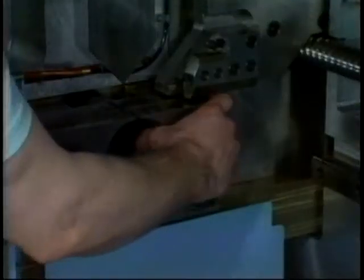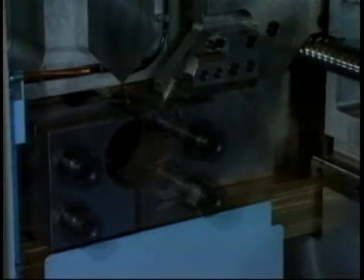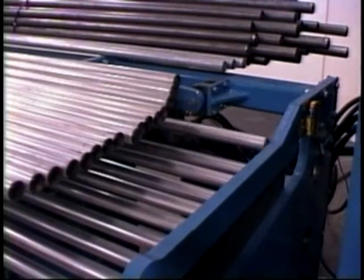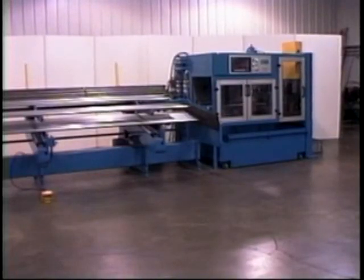This process provides a high-quality tube end ready for further processing. Our quick-change cartridge type tube clamp and advanced CNC tube hitch feeder ensure the fastest changeover in the industry. When equipped with our indexing conveyor loader, these systems excel at feeding and cutting small diameter and shaped tubing.